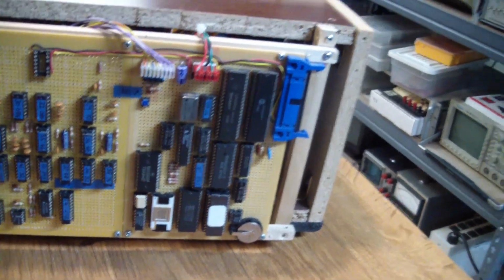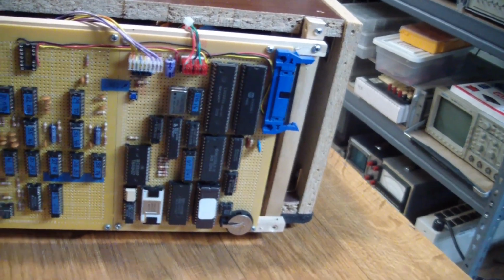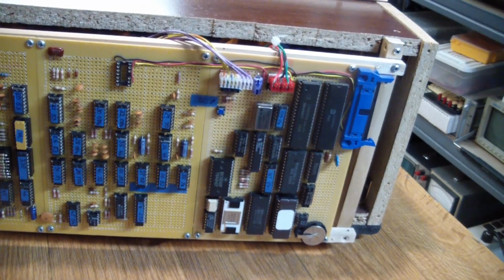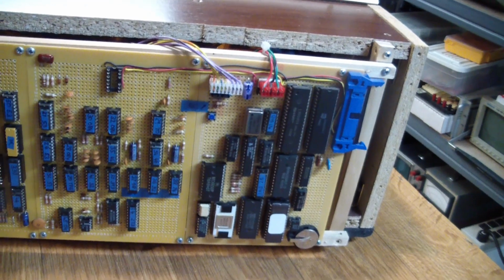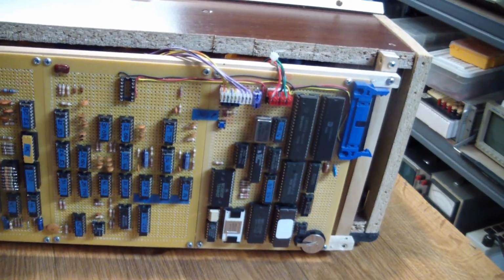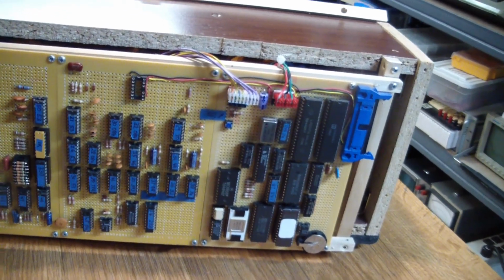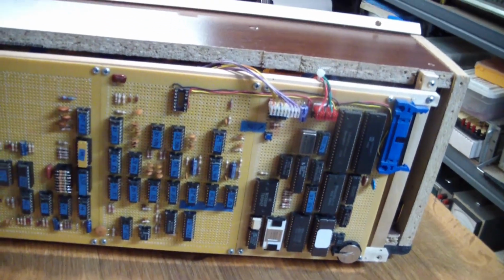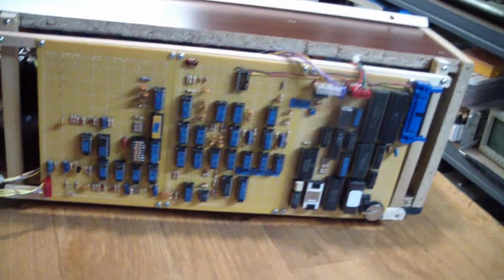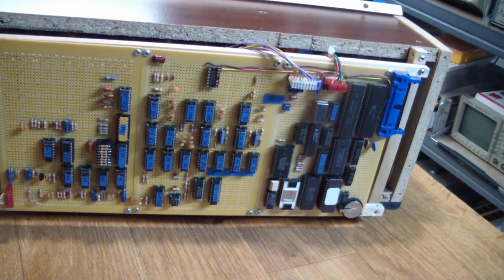Well, the schematics first of all had some errors in them, and they had a few things in there that I really didn't like. For instance, there's a memory protect for the RAM, which holds your patches, and what that's supposed to do is when you're turning off the machine and the 5 volts is dropping, you can get into situations where RAM gets corrupted depending on what signal is still alive, is the right signal getting toggled or whatever. And there was a circuit in there that basically disabled RAM access when the voltage fell below 4.5 volts or something, but it just didn't work. I couldn't get it to work right. So I replaced that, and we'll talk about it. I gave it more RAM and just generally changed a few things that I thought I could simplify.